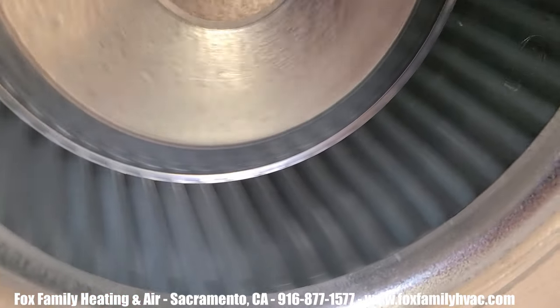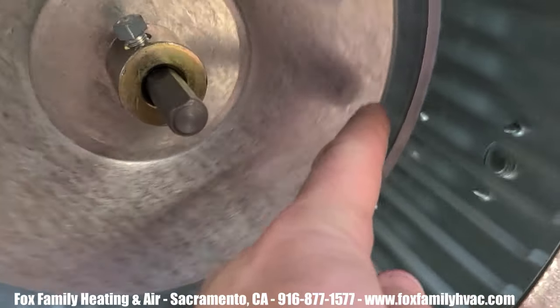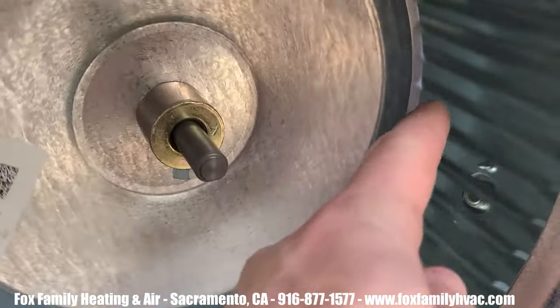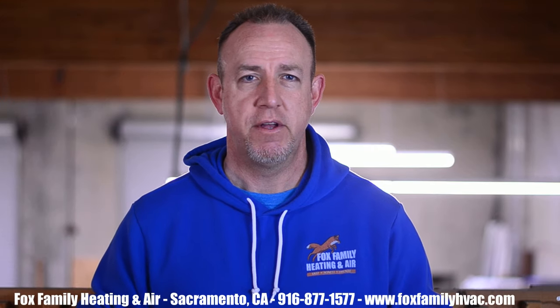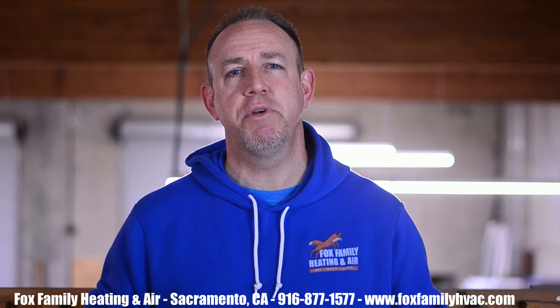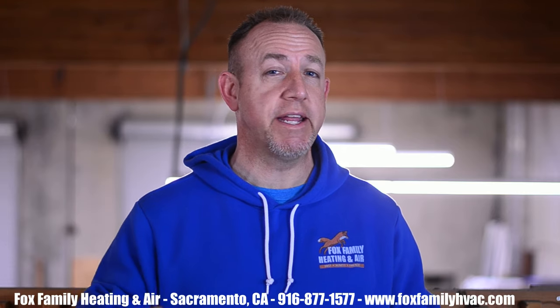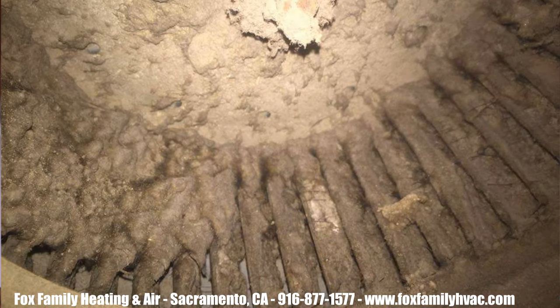The air pushing back against the cups will cause metal on metal friction, creating the noise. The spine attached to the rotor shaft is spinning much faster than the separated wheel itself. Replace the blower wheel and retest it. Next, I've seen blower wheels get so dirty that you need to clean them just to get the air moving again. The cups or scoops are filled with so much dust, dirt, skin, and hair that it really weighs down the wheel and creates a strain on the blower motor.